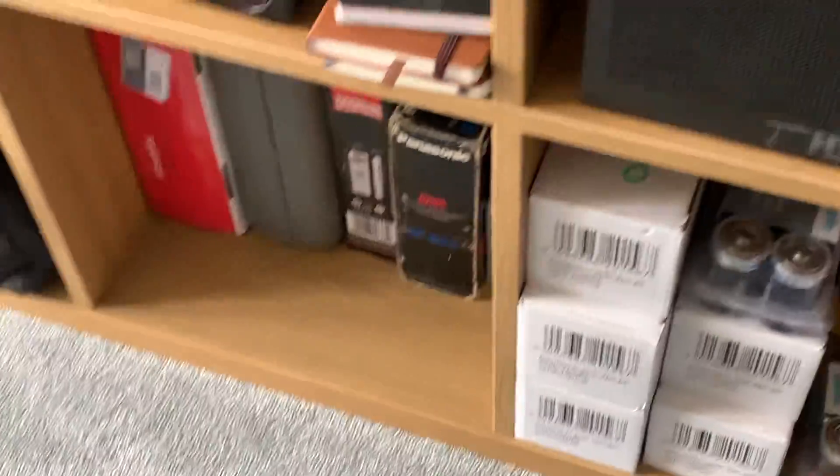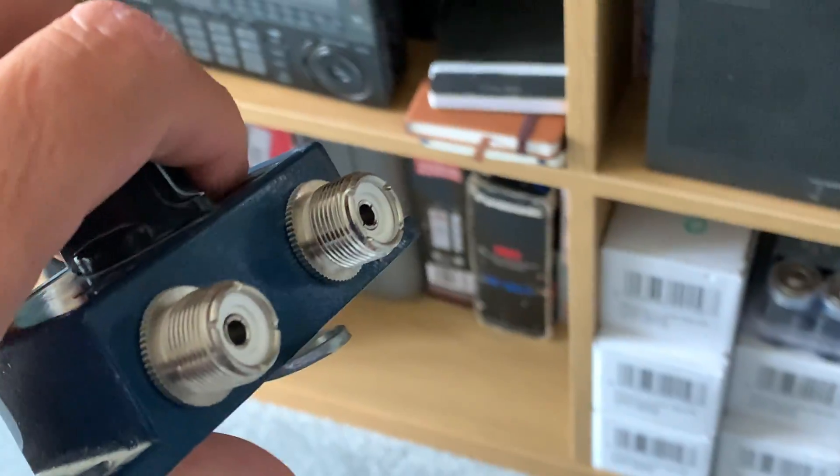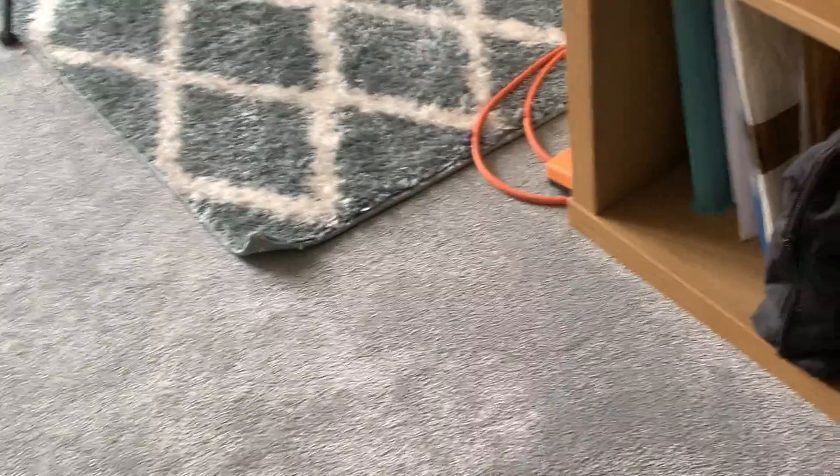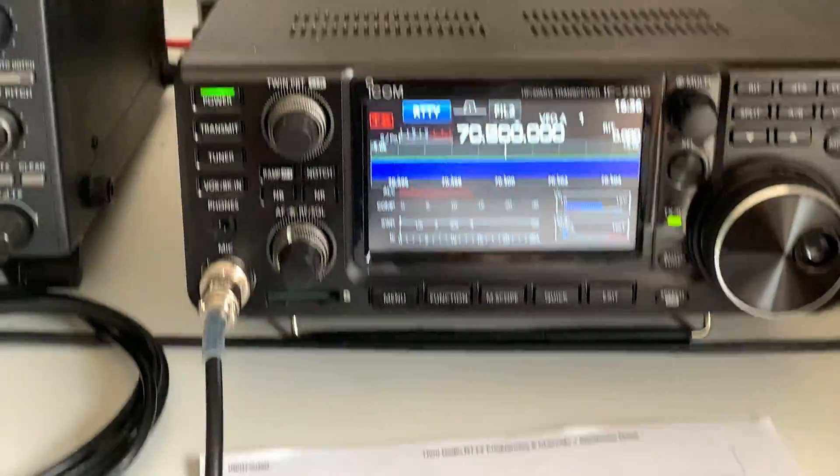So this is a piece of standard two-inch waste pipe where I wound eight turns. Basically: 1.07 meters of RG58 without the shielding, 1.07 meters with the shielding, waterproof both ends, then from that point wind eight turns onto the pipe, drill a hole through it, solder an SO239 socket, connect the coax, plug into the radio, hit the auto-match on the IC-7300, and you're away.